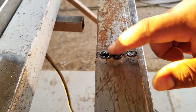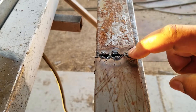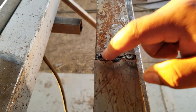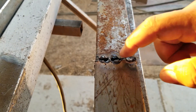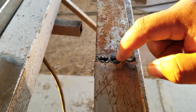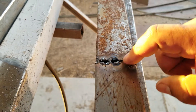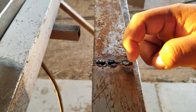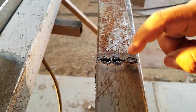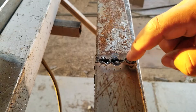The best way to avoid holes is, number one, you can go ahead and weld in smaller sections. If there's a little bit of a gap, I like to bridge the gap and split it up into four pieces or three pieces, then weld from here to here, here to here, and here to here. Small beads, tiny beads. If the material doesn't lend itself to running any kind of bead, you're going to have to just build it up in tacks. Doing that will keep the heat down to a minimum and give you a little more control over how you're shaping the metal.